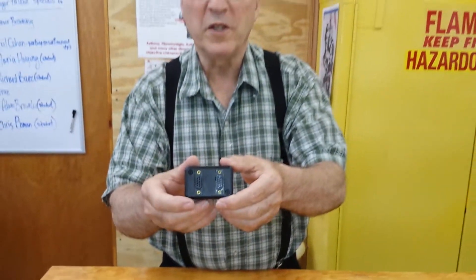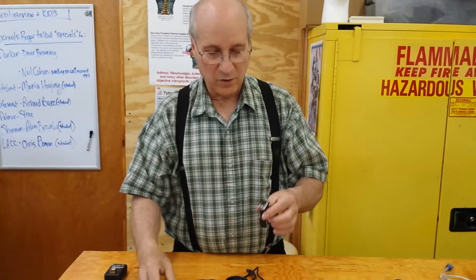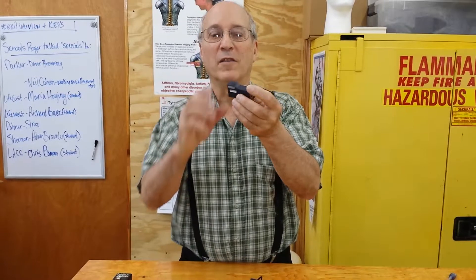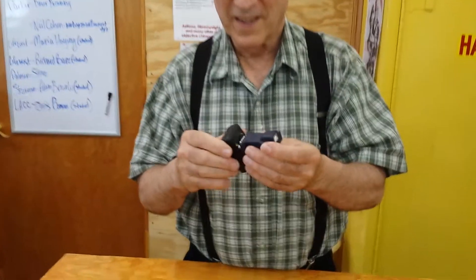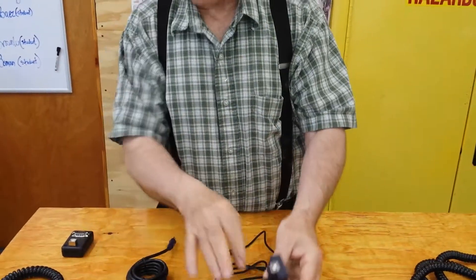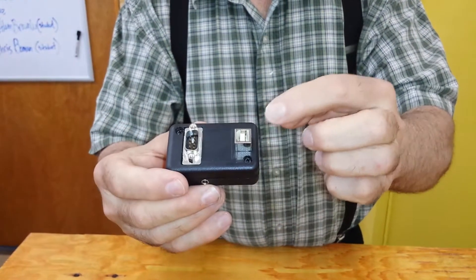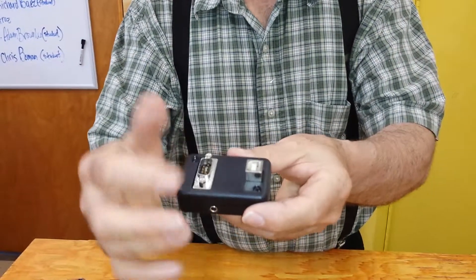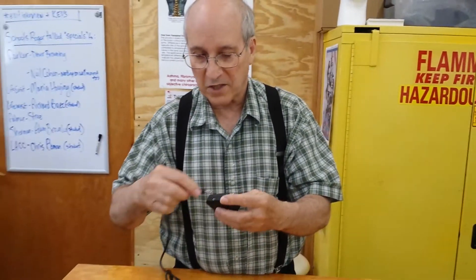The later version eliminated the cords and put the serial connectors directly in the case that has the computer chip in it, which converts a dumb serial port to a smart serial port. When USB ports came out, you were then able to come out from the smart serial port and connect to a USB-to-serial converter, and that allowed you to plug in. We also built, more recently, what we call the USB 3000, which takes the dumb serial port and goes directly to USB,